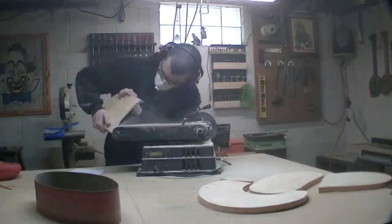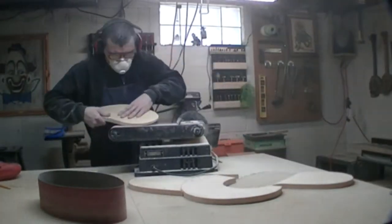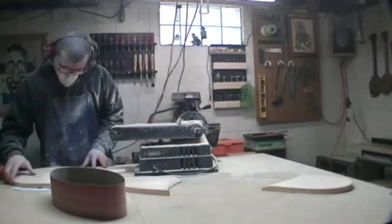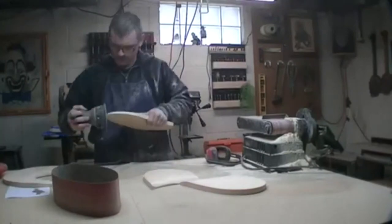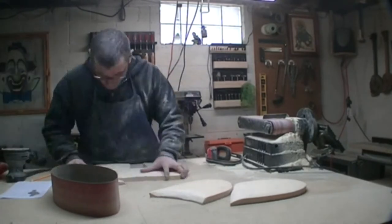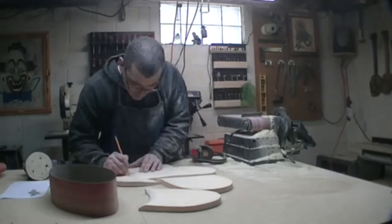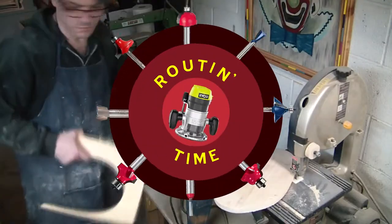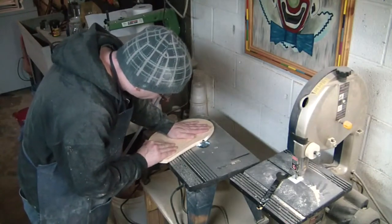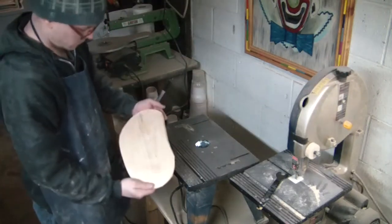This is one of my most favorite parts. You can chew away a bunch of stuff and make things all nice and smooth, and I get to wear my apron like a big boy. I made that apron when I was in high school, about 15 years old, and it still fits great — I haven't grown a foot up or out. Thank heavens. Here I am just using the orbital sander to make things look all nice and tasty. I want it to look like a smooth piece of wood that bends into itself, like it's in a knot, and it's coming along nicely. Next I took each of the four individual pieces over to the router and routed the pieces to a specific angle to make it look like the board was bent. I just used a round over bit for this.